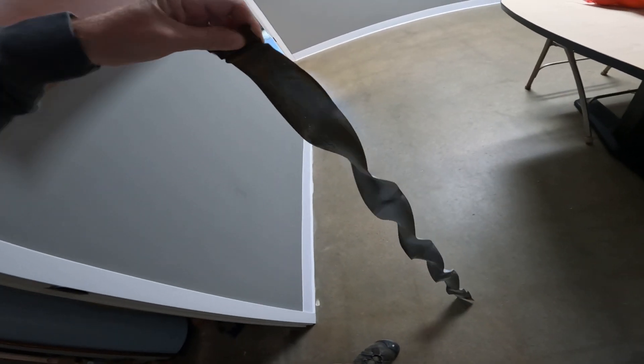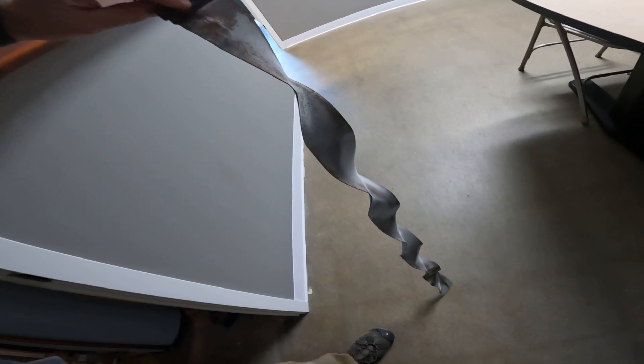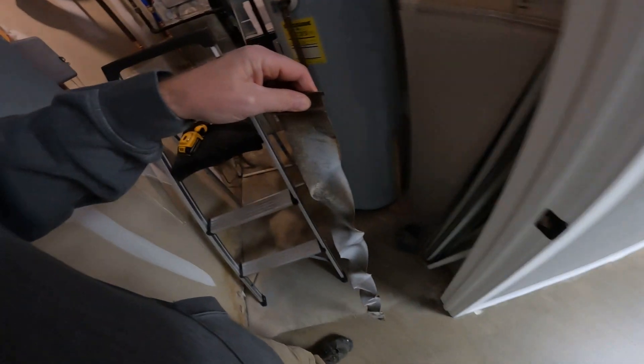There's a baffle — it looks like this. This is the flue baffle in a water heater. I don't know if new ones even have flue baffles anymore — I honestly haven't put one in for a couple years. But they're a spiral thing: basically the heat goes up from the bottom through the flue of the water heater and the baffle slows it down a little bit to provide more heat to the tank.